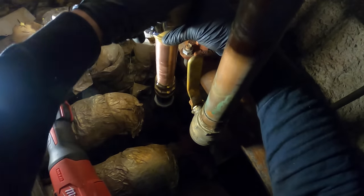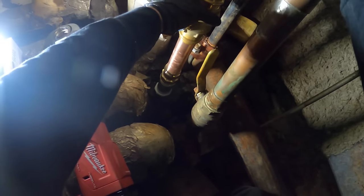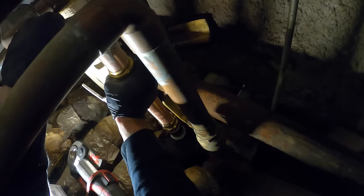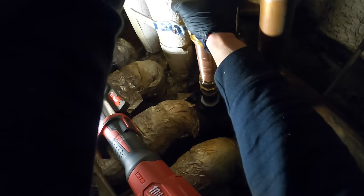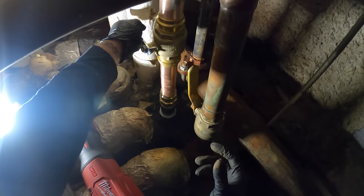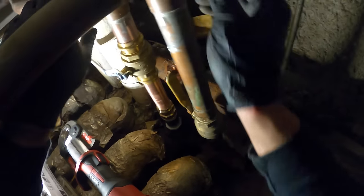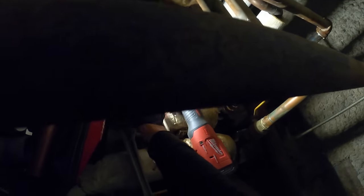Let's get this valve on here. I'll just try to do this so we don't break the gasket. That's all the way in there. This pipe is lined up — let's get it in. I think it's just making sure we really get this top one in — I know the bottom isn't all the way. Yeah, that looks like it will do. Why not have the valve facing this way — it'll be easier to get to it in the future. Looks like we're ready to go guys. Let's press those fittings — we're in the clear.